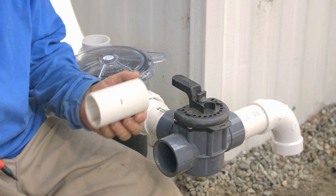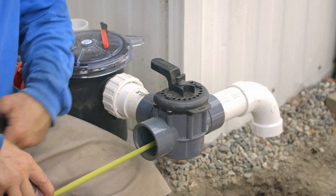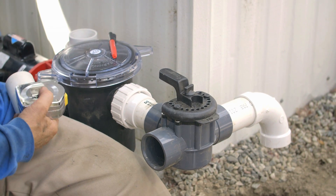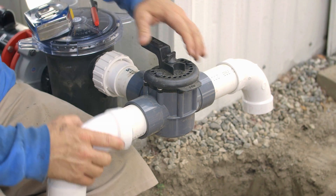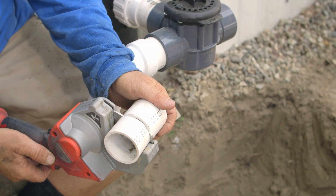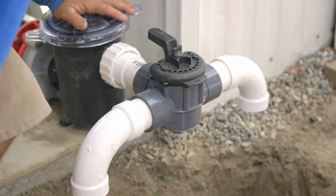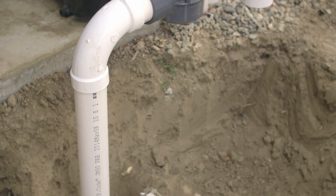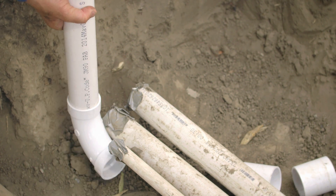I'll make a mark right here, and that's where we'll go ahead and cut this. We can double-check it with a pen. This is about an inch and a half in here, and this is a short collar — I've got an inch right there. So I need about a two-and-a-half inch piece — that's what we're going to be cutting. So those are the actual pieces we're going to glue. One of the next things we're going to do is have these pipes coming down — that's about the right height for the tie-in. Let me cut a couple of these.